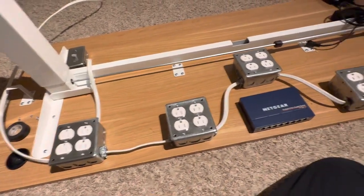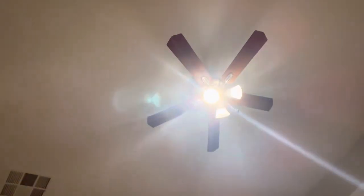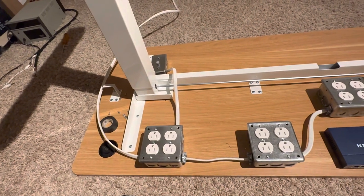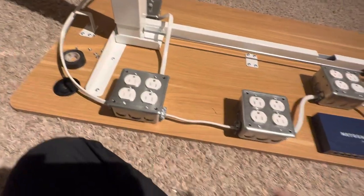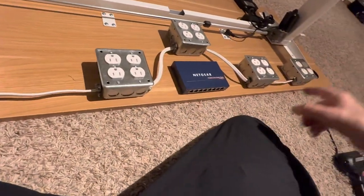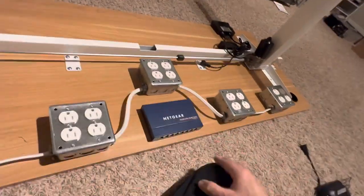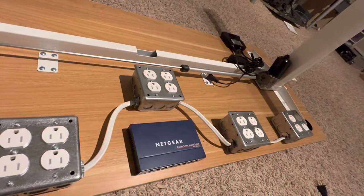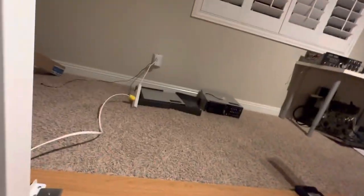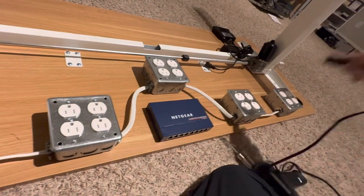I would have been done sooner but I couldn't find my meter, so I just plugged it into the wall socket the first time and the light immediately went out — boom, a short. Looks like I had the neutral wire connected to the ground. I started pulling outlets apart, and usually what happens is with so many wires rat-nesting together you shove the boxes in and wires cross. I took them off one by one — of course the very last one had the short. Once that neutral-to-ground issue was fixed, the whole rack powered up and all the plugs tested working.